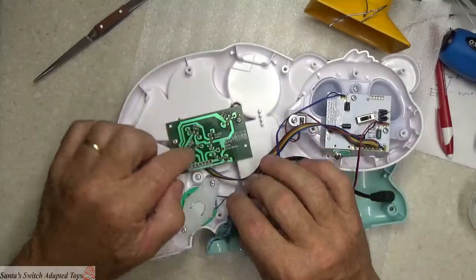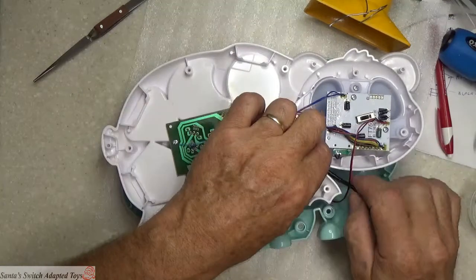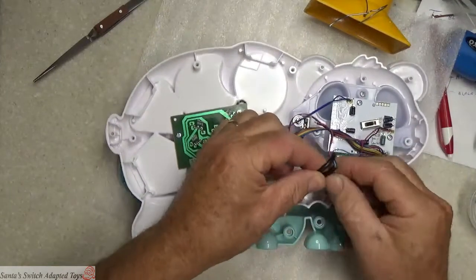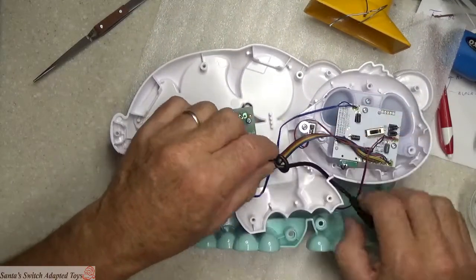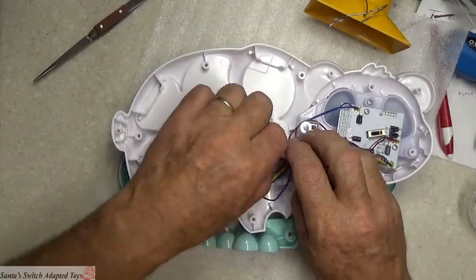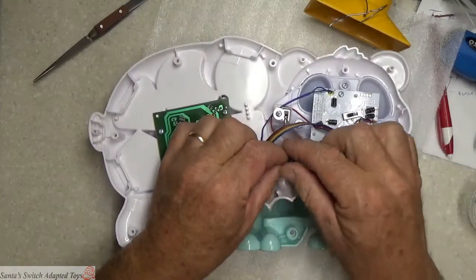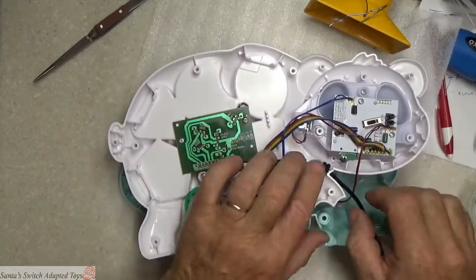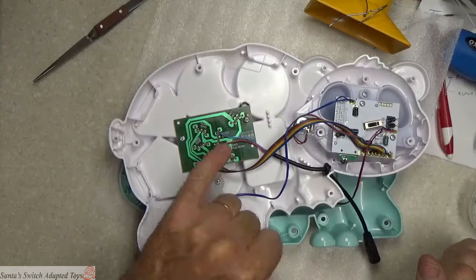I need it to reach here — I need that much wire. I always tie a knot, so we're going to tie a knot in this cable. That's an anti-strain relief so this cannot be pulled out. We want the knot to allow us to have enough wire to reach those switches without stress, so we want just a bit more. Tighten that down and that becomes our strain relief — these cables are long enough to reach over to the quiz button contacts.